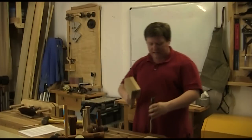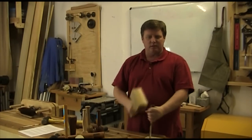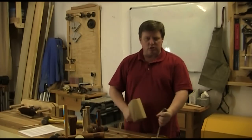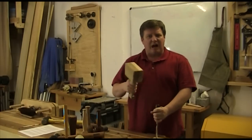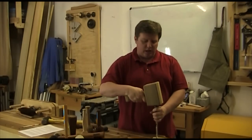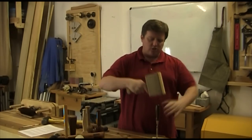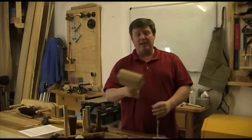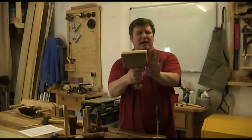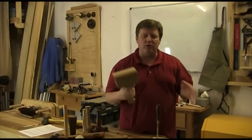If you start striking things, even if you have to drop your arm, the strike angle is going to be too extreme. Your chisel just bounces right off. So to compensate, we have to cant our wrist into an unnatural position in order to strike something properly and get the strike face to 90 degrees. Now we can compensate for that a little bit by changing the angle of the face of our mallet. The problem is, that is variable to how you're using your mallet.